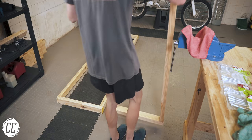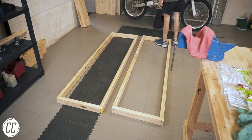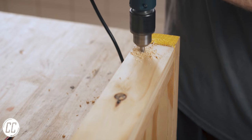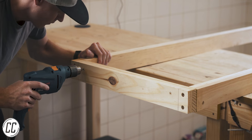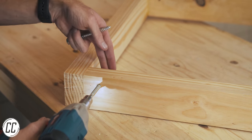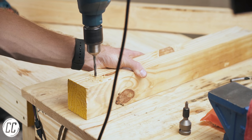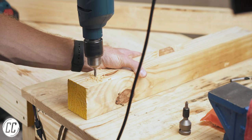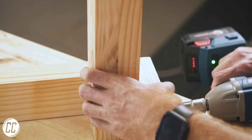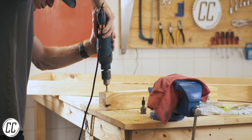With one frame completed, I repeated the exact same process to make a second one. I pre-drilled pilot holes for the legs to be attached to the two frames, but this time I used man-sized coach screws. I cheated by using the screws to mark where to pre-drill the legs before applying a liberal coat of wood glue again and putting my impact driver to use, which made light work of these beefy screws that should take up the weight of a bike nicely when spread across six legs.